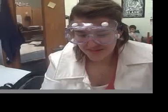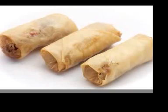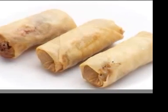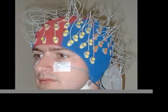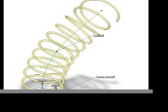Similar to the famous rubber band experiment, dielectric elastomer actuators, or DEAs, employ a sheet made from silicone or a special VHB glue connected on top and bottom by two electrodes. When activated, the opposing charges cause the sheet to expand, and the material can be manipulated to take on different shapes. Current designs include spring roll actuators, which allow three directions of movement and are composed of elastomer sheets coated with electrodes placed over a helical cord. Different voltages allow each part to be activated separately.